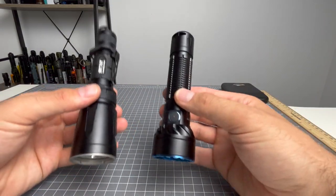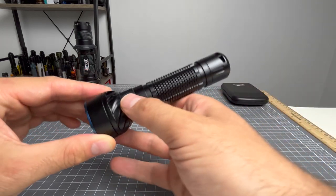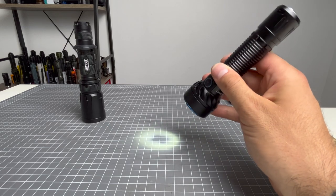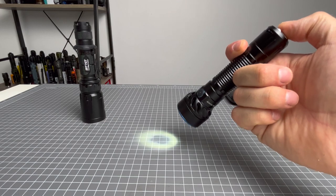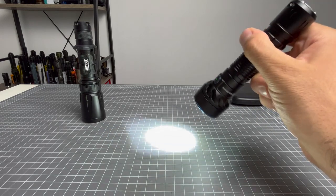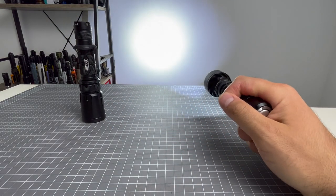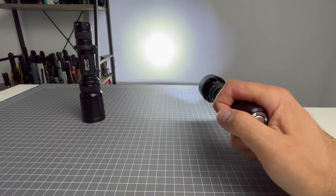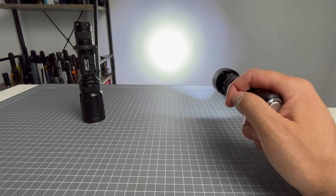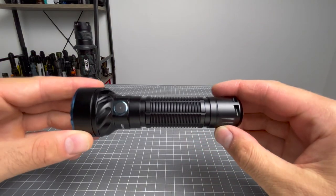The modes for the Freya in white light: you've got three modes. Moonlight Mode — press and hold from off — gives you 5 lumens for 15 days. Low Mode is accessed by half pressing (not full pressing) the tail switch, giving 300 lumens for nine and a half hours. Turbo Mode is 1,750 lumens for two minutes, then it drops to 49% for 150 minutes, then a further 17% for 28 minutes before shutting off.